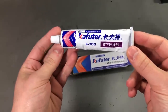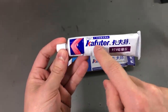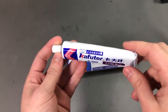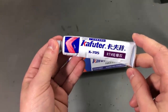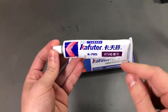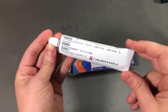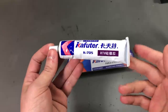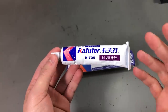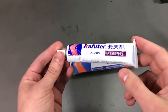Next I have a tube of transparent silicone adhesive, model K705. I'm not even gonna try to pronounce the brand name, but you'll find this stuff on AliExpress. I wanted a silicone adhesive I could use for electronics, and this seems to have that recommendation in the product specs. I plan to use this for stopping components from flapping around, or to attach thermocouples or thermistors to various heatsinks and parts. The adhesive must be non-conductive, heat resistant, must have good adhesion, and must not decompose or become conductive over extended periods of time.